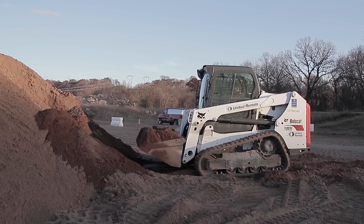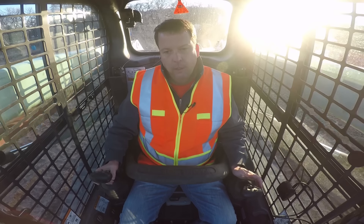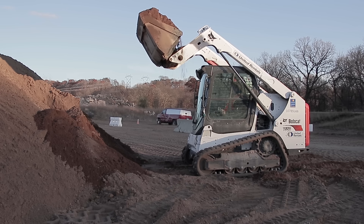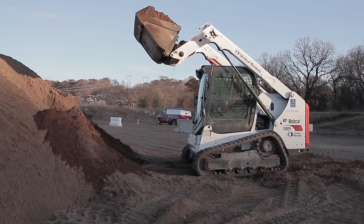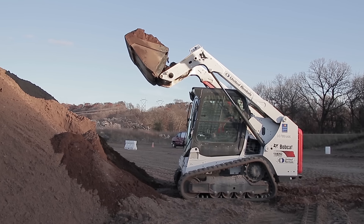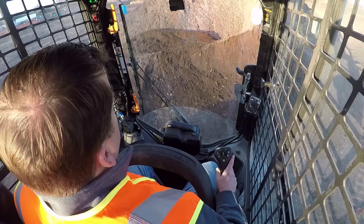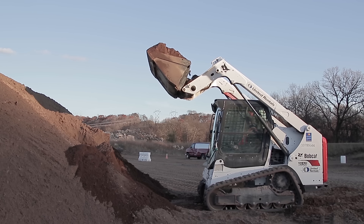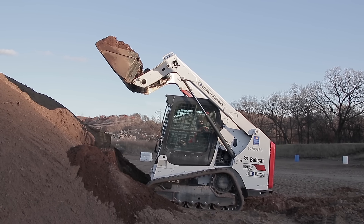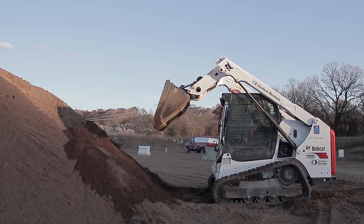The only time you're really going to get in trouble in a skid steer is when that bucket is up above you — this is the biggest mistake I see. Right now I am fully loaded. You can see something spilling over the back — this is where you're very unstable. This is where new operators get in a lot of trouble. It is really not that difficult to flip a skid steer, and if you're a new operator, it will scare you. If you're seatbelted in, there is a way you can right yourself, but obviously you don't want to get in that situation. When you're up like this, you're very top heavy, so you should only be inching forward slowly.